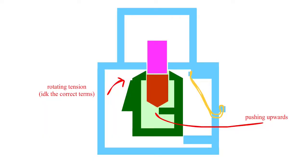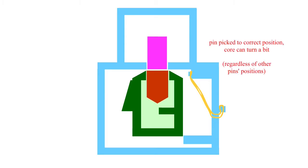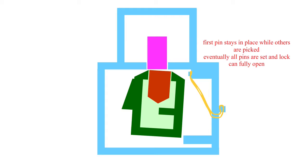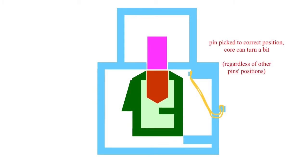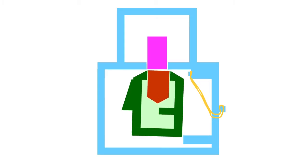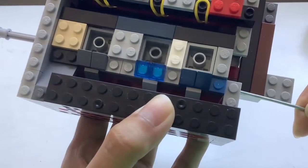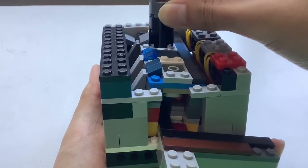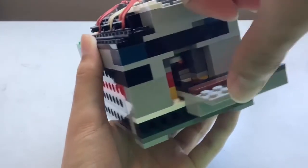As for picking, I'll go back to the bad animation. Tensioning the lock will slightly turn the plug even when it's locked. When the pins are slowly pushed up and reach the right point, the driver pin will be able to get stuck on the small edge that this little rotation creates. Once this process is repeated for all of the pins, the lock can turn. On the real lock, you can see how the metal wire pushes up the key pins, and here I try to demonstrate how the driver pins get stuck because of the slight rotation. If I keep the top of the lock open, you can see how I push the pins in place one by one when I pick the lock.